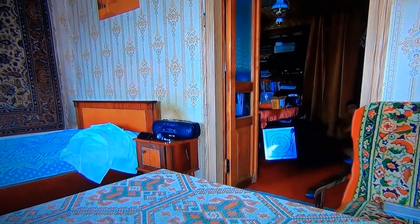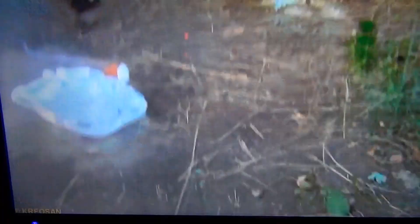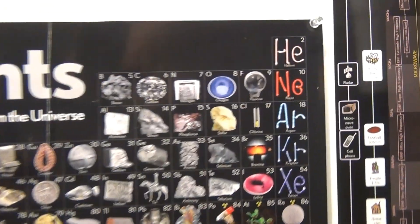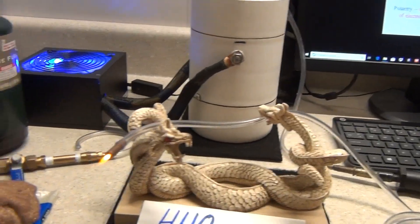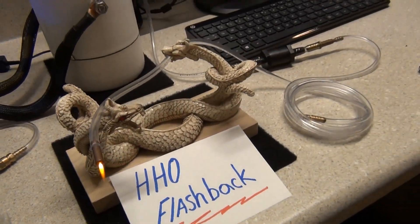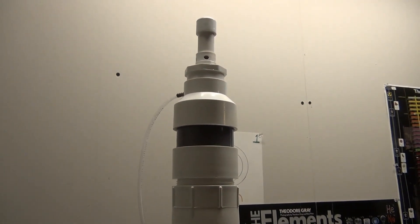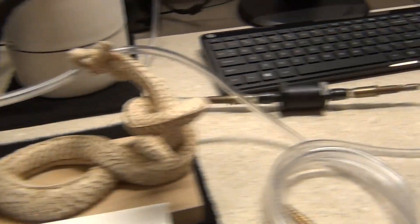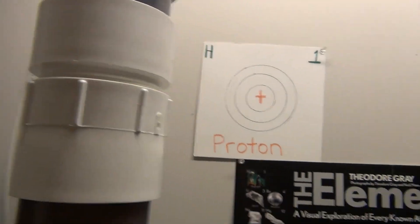Hydrogen is a dangerous thing. The oxygen atom has a lot to do with the flashback. I have a flame lit — I was expecting it to just flash back all the way down the hose and past the flash arrestor. I'm going to shut off the power and it will flash back on me, all the way back to the top. The little bud jumped off the end there — it slipped past the flash arrestor and went all the way back to the reactor. Design is everything: make sure you design it so it can handle the flashback under any condition, at any rate.